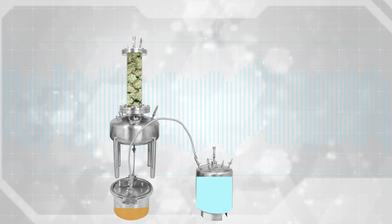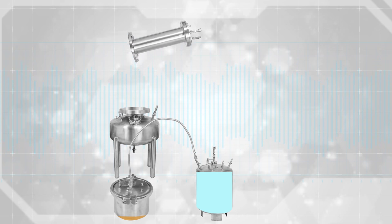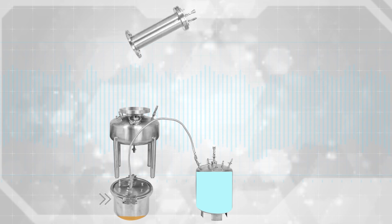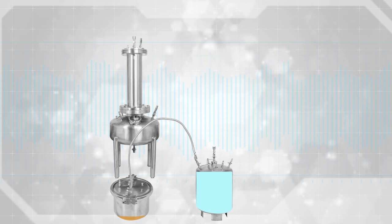Step 7: Closing the wafer valve and removing the column. While waiting to recover the final trace amount of solvent into the recovery tank from your dryer tank, you can break the system down to expel your spent column of plant material and reload it to perform another extraction, or you can have a preloaded column ready to go. Emptying the column is an easy job with the removal perforation plate that expels the column's content from below. Be sure to close your wafer valve on your extractor tank to seal it so you can safely remove the column, preventing flammable vapors from being expelled into the work area. This also prevents solvent loss from the solvents that filled and vapor-locked your tank. The extractor tank is self-cleaning and will never need to be cleaned so long as you drain it into the sucker tank. It is common to perform as many as 5 extractions and 4 recoveries before opening the sucker dryer tank to access your finished product. This allows you to eliminate unnecessary steps involving removing your product from the dryer tank when extracting repetitively from the same material.